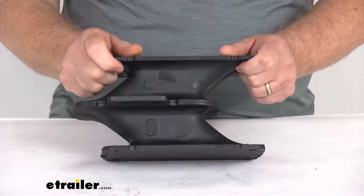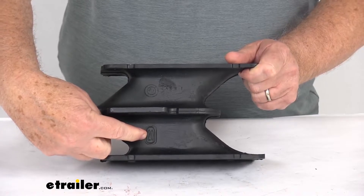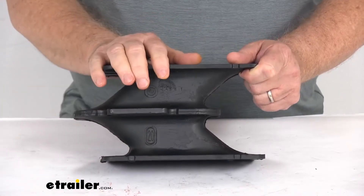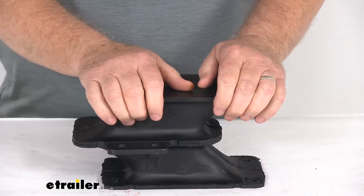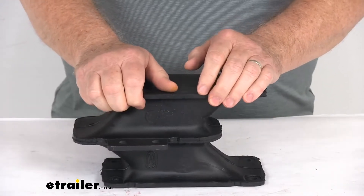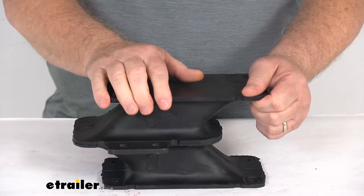You can tell by looking at the spring right here — it is stamped with a number 20 on the spring itself. The rubber shear spring should be periodically inspected for any tears or cracks. If the rubber spring has a 3-inch long and 3-quarter inch deep crack or tear, then the rubber should be replaced.